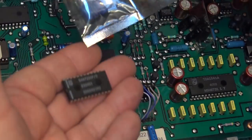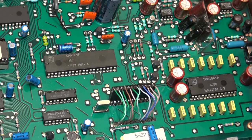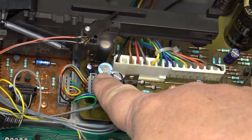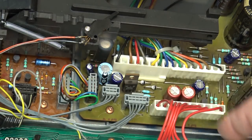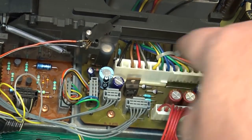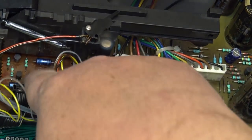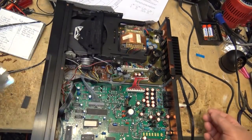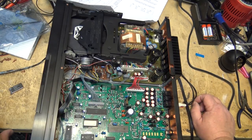Perhaps the guy who owns this bought it used and this work was done prior. Maybe the shop technician looked at it, saw it was in a state, and decided to just tell the customer they changed the chip — to make it look like they did something for the estimate fee. I can see that some capacitors have been changed — the original Philips ones would have been nice red ones, and several here have clearly been replaced. But the IC story I'm not sure about.